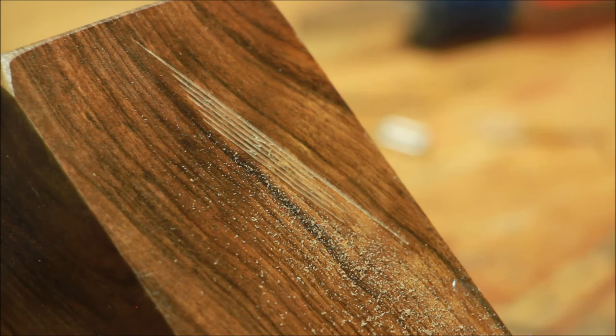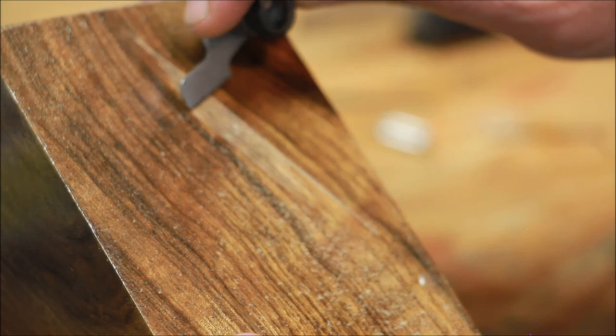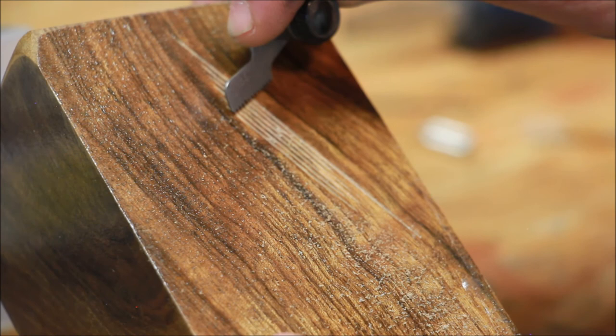Once you've got a few lines, I like to use a thread pitch gauge that measures the lines per inch. Simply insert it in there and adjust accordingly — right to widen it or counterclockwise to narrow it. Now we're setting up for 22 lines per inch, and this is right on the money already. So we are ready to begin checkering.